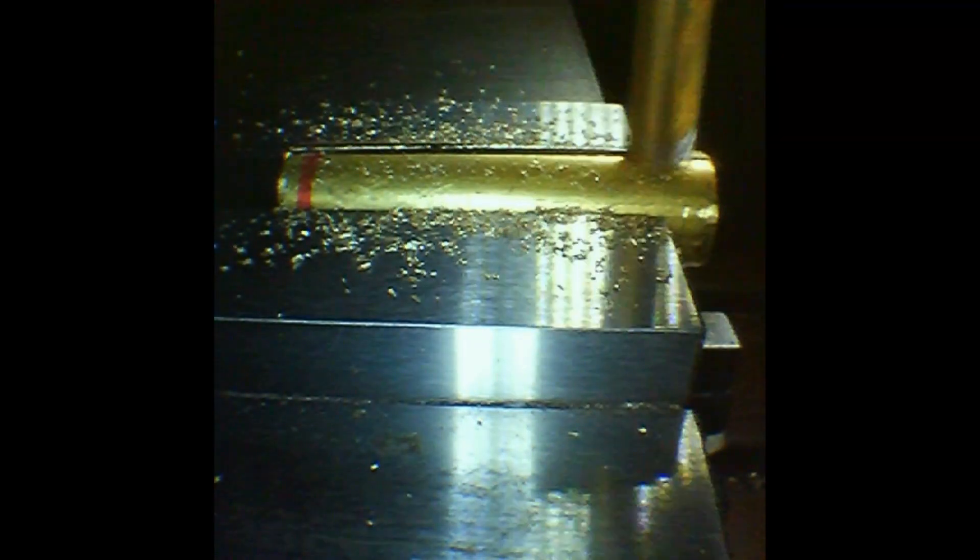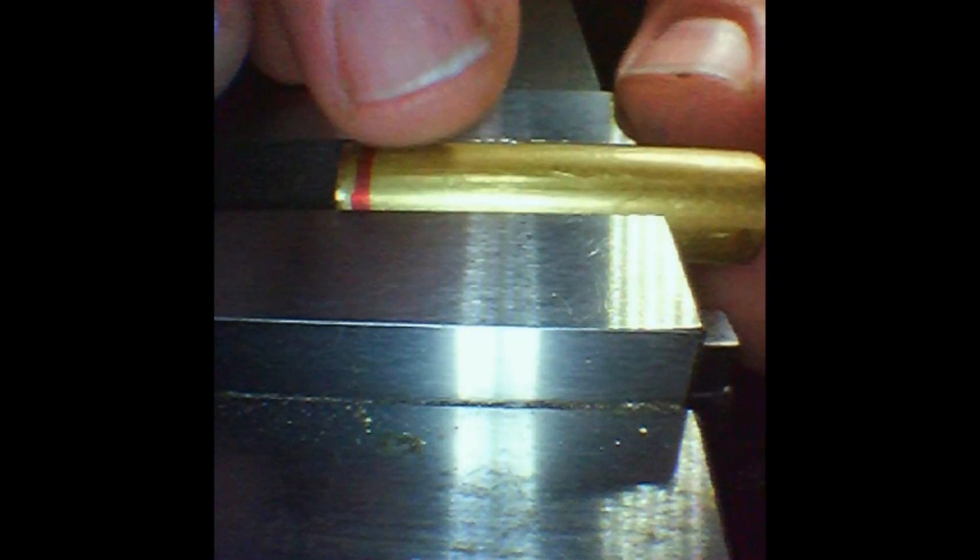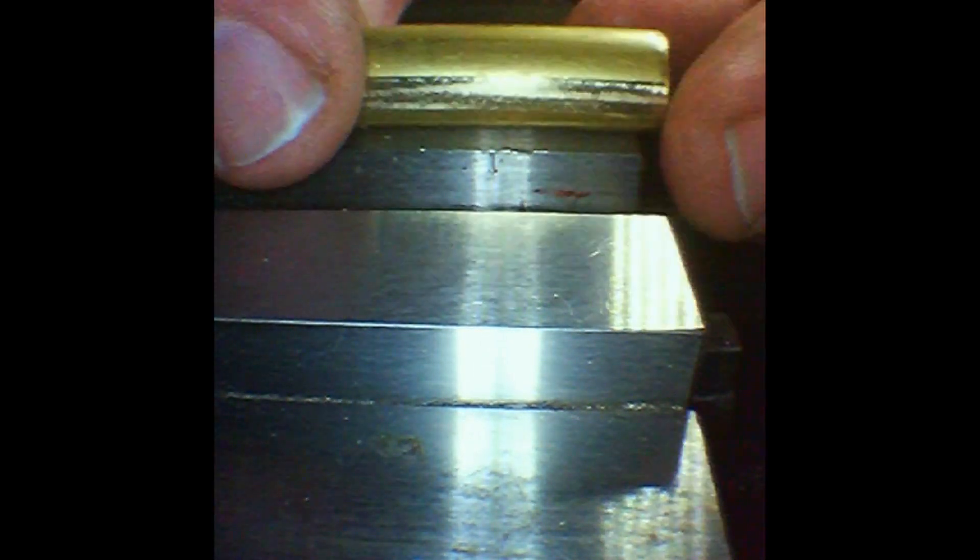I start out with this piece of brass. I'm milling some flat spots on it so that it's easier to hold in the vise. These flat spots will make it easier to make 90-degree angles on the succeeding holes I need to drill. If I just try to hold it with no flat spots, the holes won't be lined up the right way. Just making the flat spots about the same width across — just eyeballing it. If one flat spot's bigger than the other, that messes the center line up.